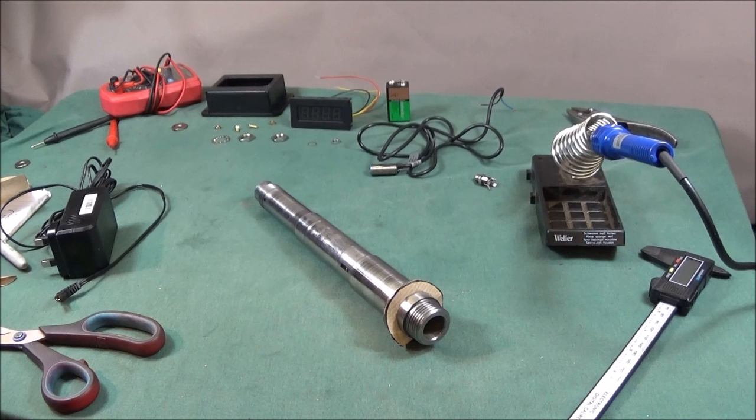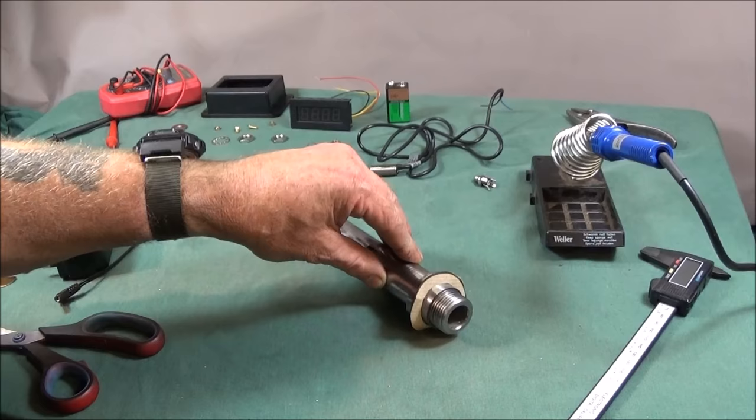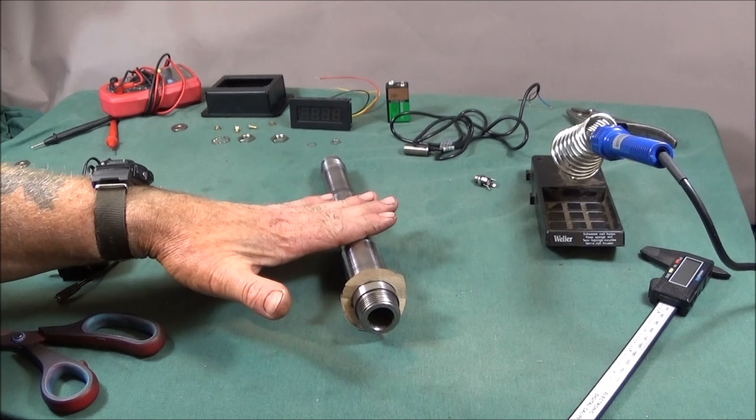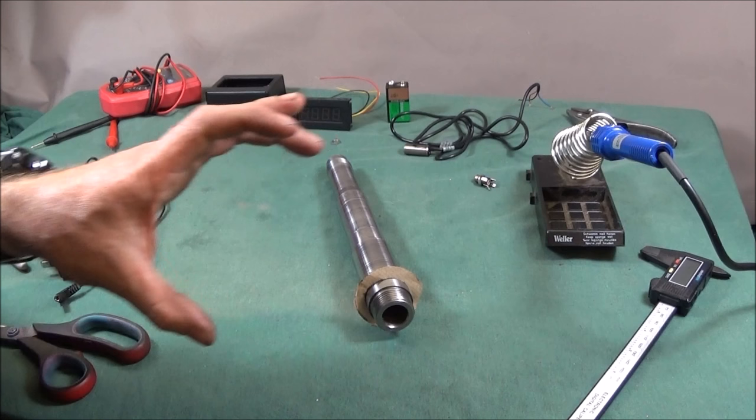I tried it out earlier on the lathe and done some machining and I was really surprised with the results — I was able to just undo the chuck by hand without any problem at all, and it didn't cause any extra run out on the chuck. My ML-7 hasn't got a reverse switch for the spindle so it's safe to use this method, but any other lathe with reverse I wouldn't use one of these on, because the chuck would be prone to unscrewing when machining.